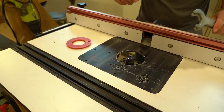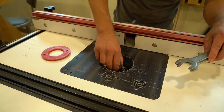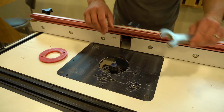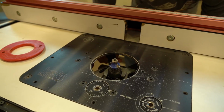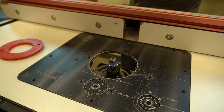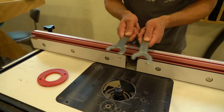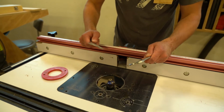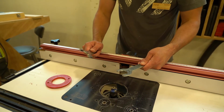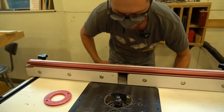And then the collet, it's a little hard to see, but it has two nuts. One is the actual spindle of the machine, and one is the nut that secures the collet. So you're going to come in below here. Now, when you're loosening the collet, you're pulling the wrenches away from one another. When you're tightening the collet, you're pulling the wrenches towards one another. The one in my left hand, which is on the spindle, is really mostly just holding the spindle stationary, and the right one is loosening the nut.